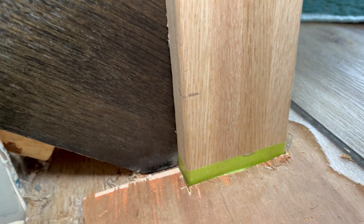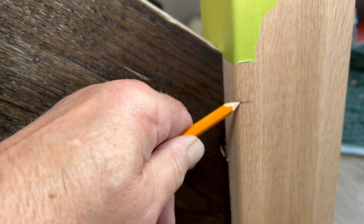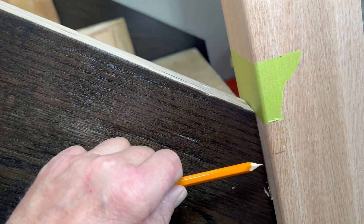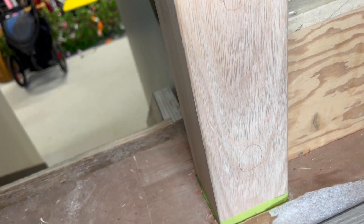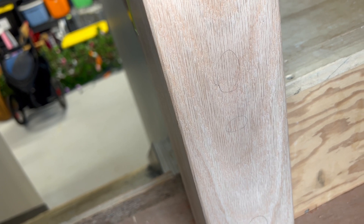I've marked here and here — that's where I'm going to put my lag screws, two lag screws, in from the front of the post into the stair stringer. I'll take those marks and with a square move them over to the front, then start augering out my holes. I'll start with a three-quarter Forstner bit, then taper down to a quarter inch, put it back in place, and put pilot holes into the stair stringer, and we should have a real good fit.